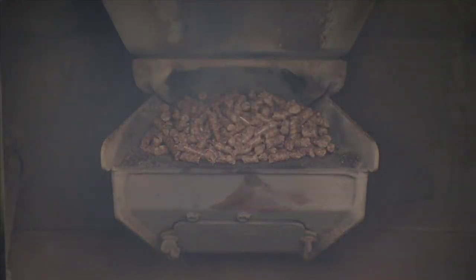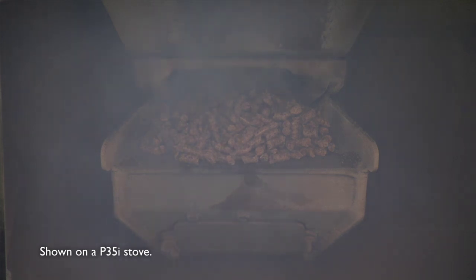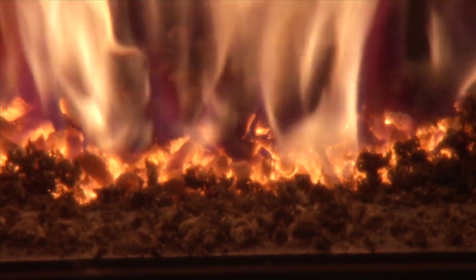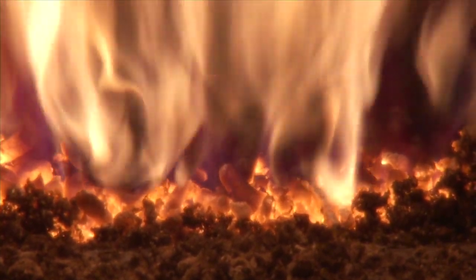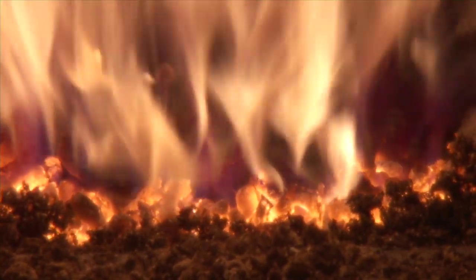Take note that some smoke may be visible in the firebox prior to ignition. This is normal. However, if the burn pot is not cleaned at proper intervals, you may see excess smoke in the firebox, followed by a slight woof sound when ignition occurs. The distribution blower will vary in speed depending on the burn rate and temperature output. Note that the blower will not come on until there is sufficient heat in the insert.